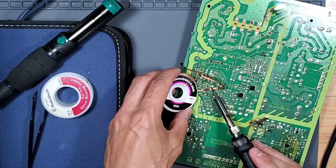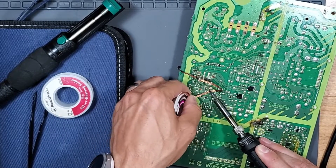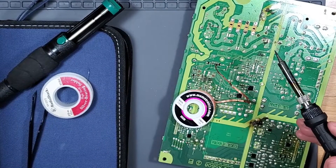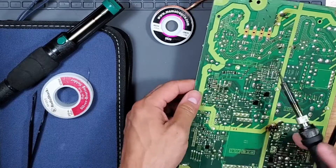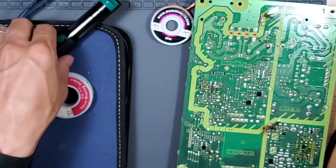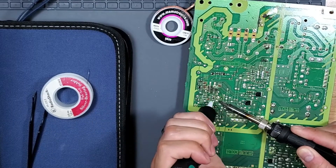You just want to apply it right there, lay it on top of the solder joint, and then heat it up. Pull and let the solder soak into the braid. If it doesn't have any flux in it, you want to add flux — you can buy flux paste separately. One side came out but the other side did not. If that happens, you need to follow up with a solder sucker, also called a solder plunger. Heat up the solder joint, let it liquefy, cover up the tip right here, and press the button — it should suck out the solder.